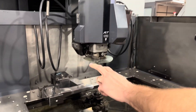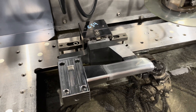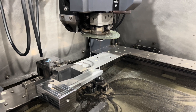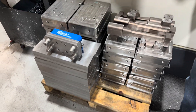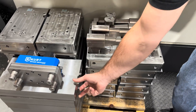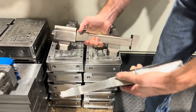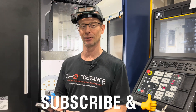We're here at the final operation of our insert. I want to show you what we've done so far — this block has been through soft milling, hard milling, 5-axis, and has been benched to a B2 finish. Now our last operation is to wire the block right off and then do the final grind, and that'll be the end of our 5x Factor. Here's another example of a different fixturing set — a Fast Mill or FCS is a great tool to hold bigger stuff rigid. Here's a block that starts off with a seriously long waterline hole in it, ends up being machined to this point, goes to heat treat, comes back, and here's our final part — a long core pull for a gun magazine. Thank you for joining us for our second episode of the 5x Factor.